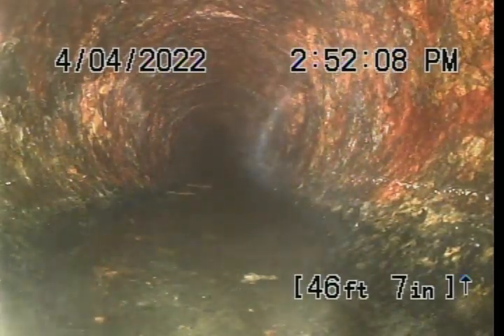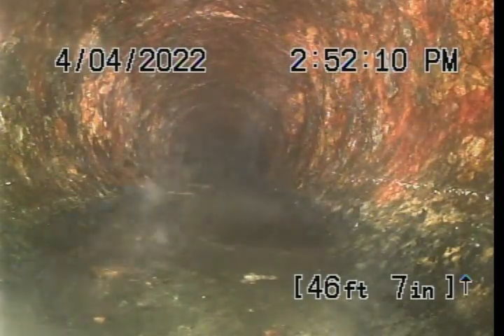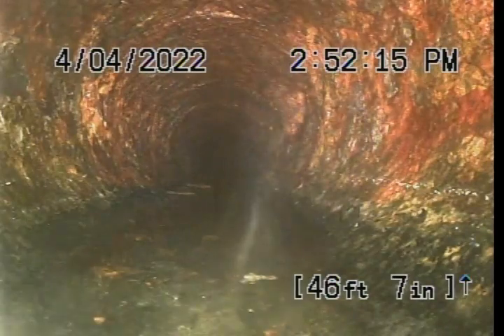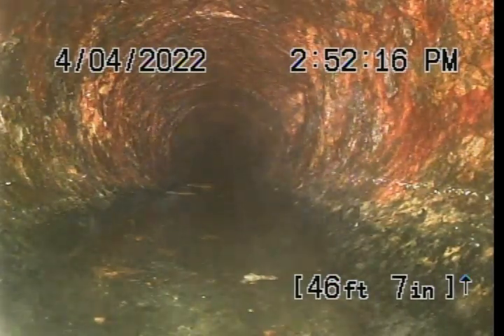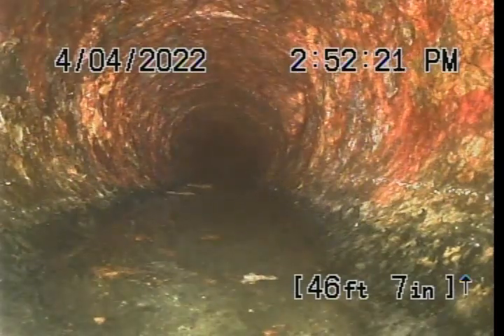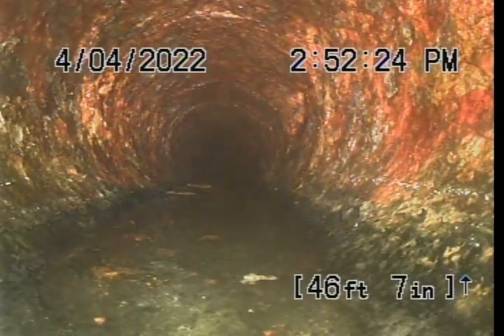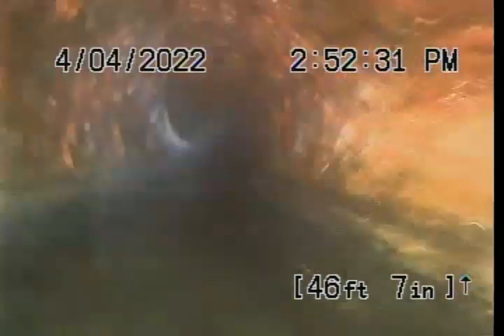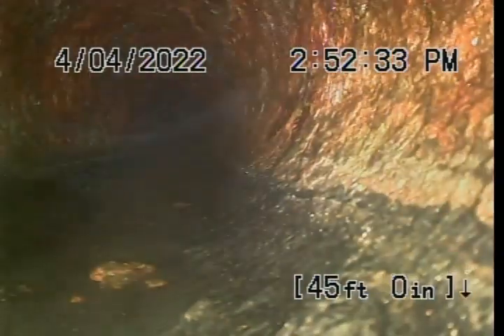If they can go low enough, you just cut that 90 right before that 90 — brother, they left you about that much pipe. You can throw a coupling on there, get past that isolation valve, 45 it, and then I would go all the way down that wall and put a sump system in the corner for the one floor drain. That's the way to do it, yes sir, because if not somebody's back is going to be having a bad day.